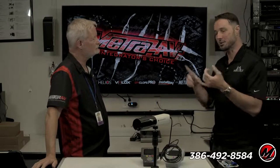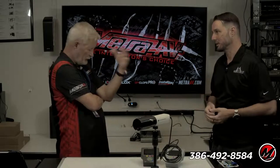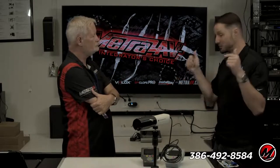We see all these transitions going on. And in the early days, and this was also a tube thing, and DLP and all the others, you would unbox your TV, set it up, turn it on, and it would be in the brightest picture mode possible. Retail mode. Vivid mode, dynamic mode, and that's what we see in the retail stores today. What we had to do back then was detune them to calibrate them. Oh, it's way too bright, the contrast is way too high, the whites are clipped, the blacks are way too low to look more dynamic, but we can't see shadows, color saturation's cranked up to make colors more colorful, but skin tones look really weird. All this weird stuff was going on. So when we would detune, say, a plasma, you would look at it and say, it does look better, the fidelity is better, but man, it's a lot dimmer. Or flat. And it was a bummer, right?